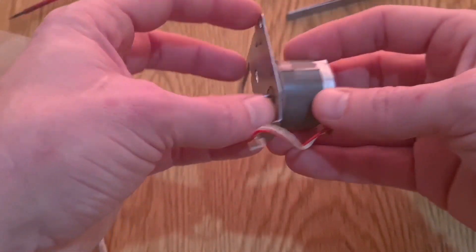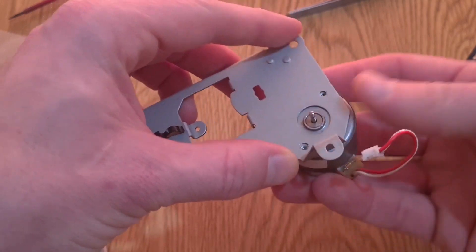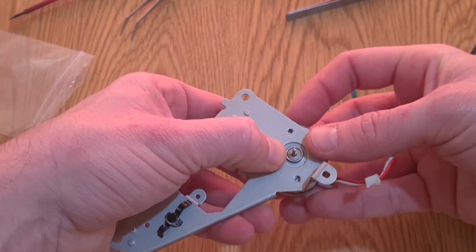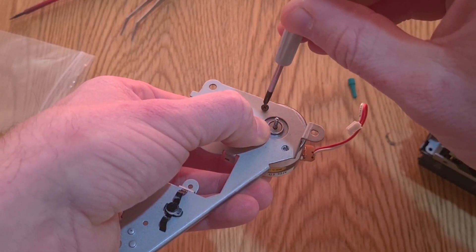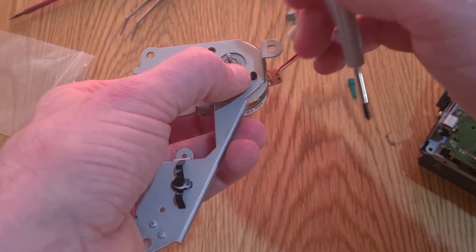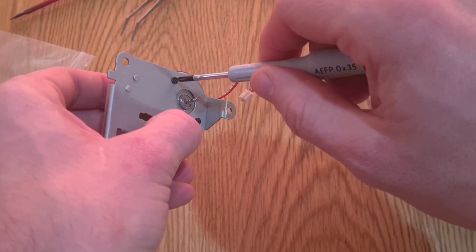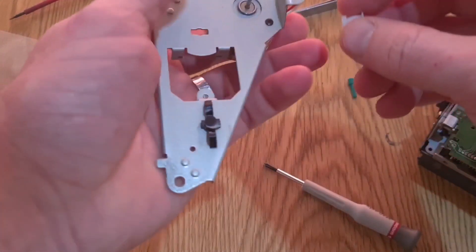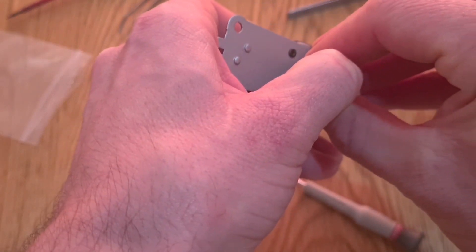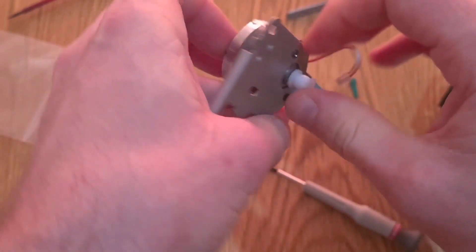Although it's easier to have the door open it's less risky. Now we can fit the new motor - the wires need to be facing the way shown in the video so they can plug into the top of the transport. It's just two little black countersunk screws that screw directly into the motor and hold it in place. These motors are used in all sorts of stuff so there are loads of holes - it's just a case of matching up the two that best fit. As long as that wire is positioned correctly, that'll become apparent once we're done because it needs to plug into the top of the transport. Don't forget your pulley - this fits with the thickest side closest to the motor, and try to get it as close to the motor as possible without it touching the bushing, which is a bit of an art.